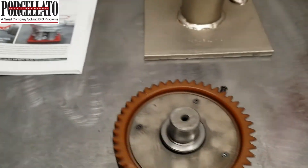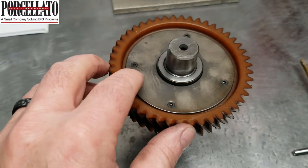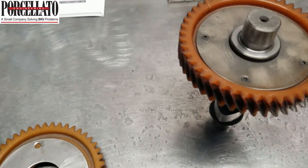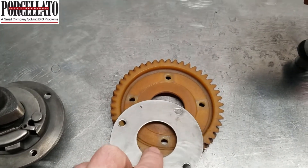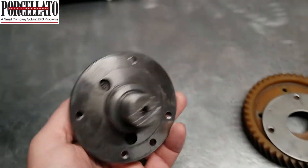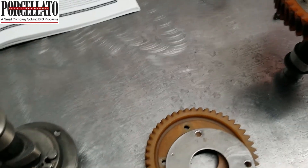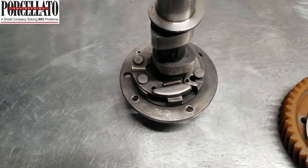What's mentioned in the book is how we fix them: we just drill off the chamfer on the edge end of the rivet, then punch it out with a punch. Then we go ahead and drill the plate and the gear to one quarter inch, and 7/32 on the cam, then tap it for national fine. The torque is like 13–14 foot pounds or something like that.